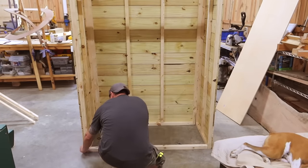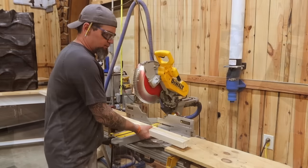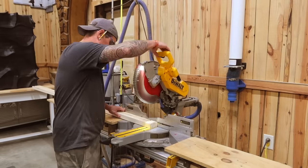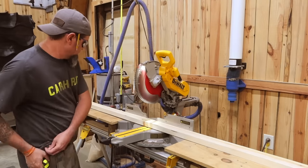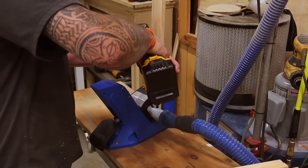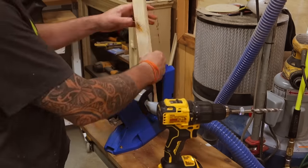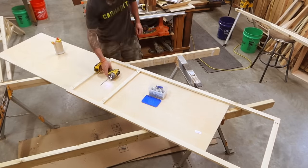After installing a 44 inch base plate it's time to start working on the doors. Anytime that I'm using three quarter inch material like this, that's all I've done is taken a two by four and ripped three quarter inch strips out of it. For these door frames I'll be needing eight pieces that are 66 and three quarters of an inch long and six pieces that are 21 and three quarters of an inch. All of the parts cut at 21 and three quarters will need pocket holes on both ends, and then we'll assemble these doors with inch and a quarter pocket hole screws.